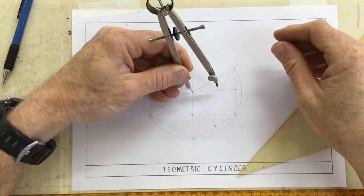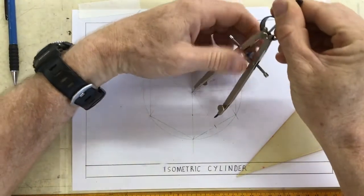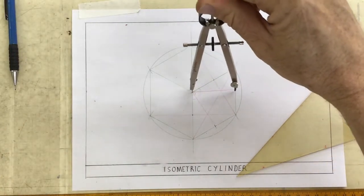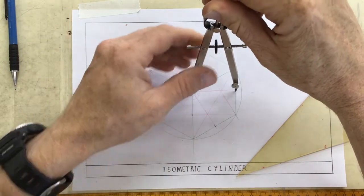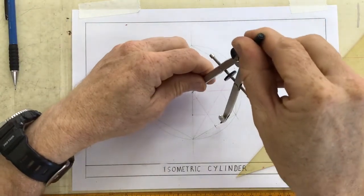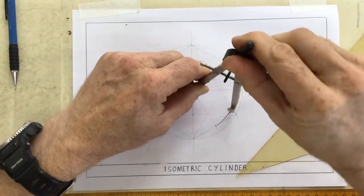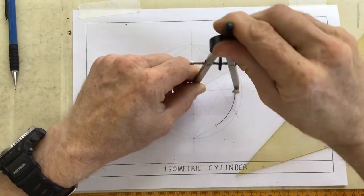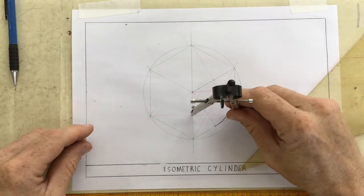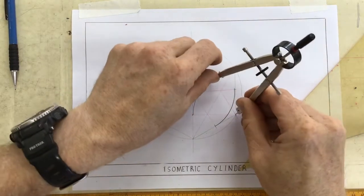Right, next step. I'm going to take my pair of compasses, place it in at that obtuse angle and wind them out so that it ends up touching the midpoint of that line, and if I come around it should touch the midpoint of that line. Just check that it is actually doing that. If it's not, move the point of the compass and adjust it until it touches there and touches there perfectly, and once you've done that you draw a nice dark arc. You then swing it around, place it in at the corner over there and draw again a nice dark arc that connects that point and that point perfectly.